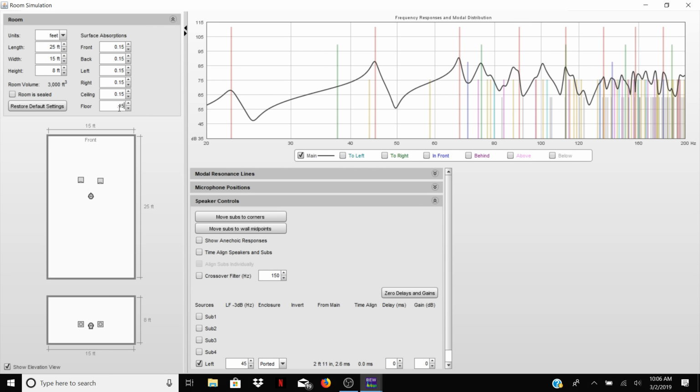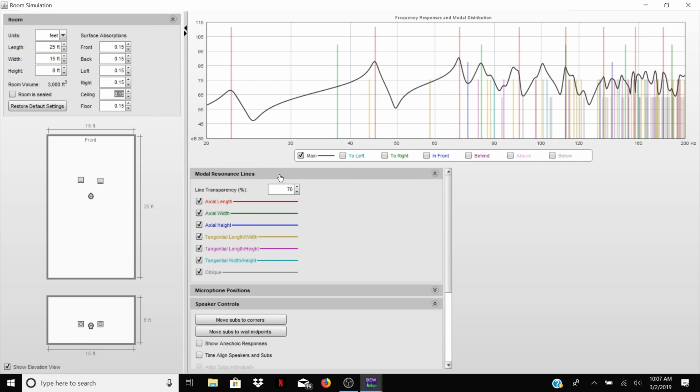which is why you'll often hear people like myself and others at Audioholics saying that the sound of bass in a room is actually the sound of the room and not the sound of the speaker or subwoofer itself. It's because what you hear is not the direct sound from the speaker, but that direct sound from the speaker having bounced around the room. As it interferes, it causes these peaks and dips, which are called destructive and constructive interference.